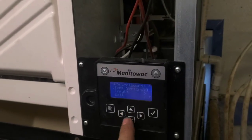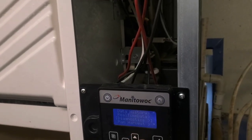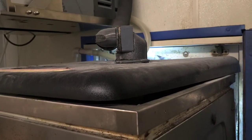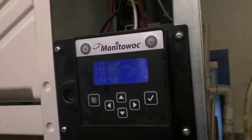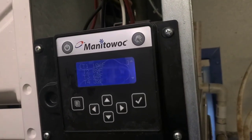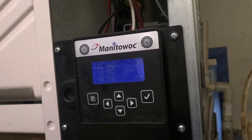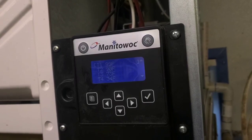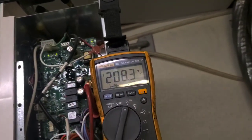Well, it's been running for a little while, so time for another manual harvest. Let's see how long it takes. I just caught it hesitating this round. This is the third or fourth time I've run it through harvest. And that wasn't rising. It was hissing real loud, and I heard what sounded like something blew through. Then T3 started to rise. And that voltage right there never fluctuated.